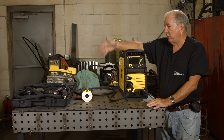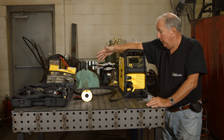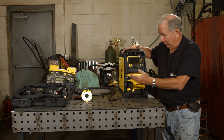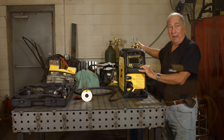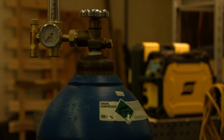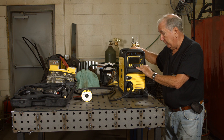We've looked at the spool gun, so now nothing left to do but hook it up and use it. We had been MIG welding with this, so we have a MIG welding gun on here — the spool gun has to attach here, so we've got to remove the MIG gun. I've already taken the liberty of changing our gas. When we were MIG welding, we were using C25. For the spool gun, because we're welding aluminum, we need 100% argon, so I've already put an argon bottle on there.